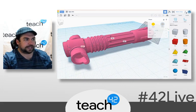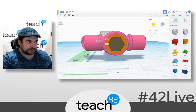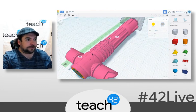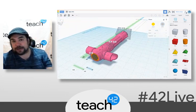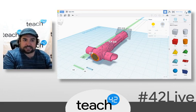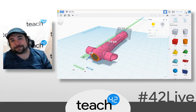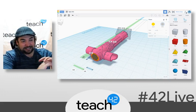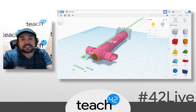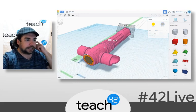I knew it was going to be approximately 28.36 millimeters, and then centered the whole thing. That was my build model to actually print out the hilt. Then I needed the actual lightsaber blade itself, which basically just needs to be a long cylinder with the top rounded. I needed the hexagonal piece so it would fit into the lightsaber as well. And I also needed to add the notch at the top so it would hold open the trophy case.